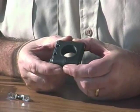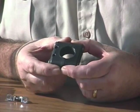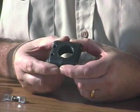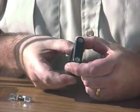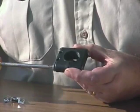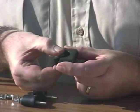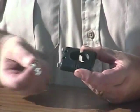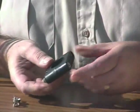This is a handy piece of hardware we've used on several of our projects — it's called a rail clamp. It'll clamp around any pushpit rail, stanchion, or other 1-inch or 7/8-inch diameter stainless steel tubing you have on your boat. It's two molded pieces of plastic held together with stainless steel screws and nuts. It comes apart very simply, and it comes with bushings so you can fit it to either 7/8-inch or 1-inch diameter tubing. You can also add an eye strap to the end. We use these to attach bungees, and also on our quick-release ladder system.